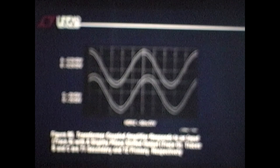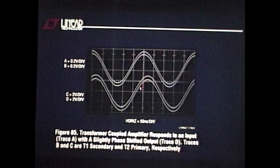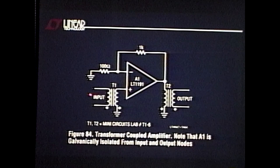The tremendous advantage is that points one, two, and three can have tens or even hundreds of volts of common-mode noise without getting into trouble, within the parasitic capacitance limitations of the transformers. Where do you pay the piper? You pay on phase. If you look at the phasing at the input and output transformers — primary and secondary respectively — you take a big hit on phase at reasonable speed. So if you're dealing with a phase-sensitive application where the output must maintain phase fidelity to the input, this is not a good configuration.